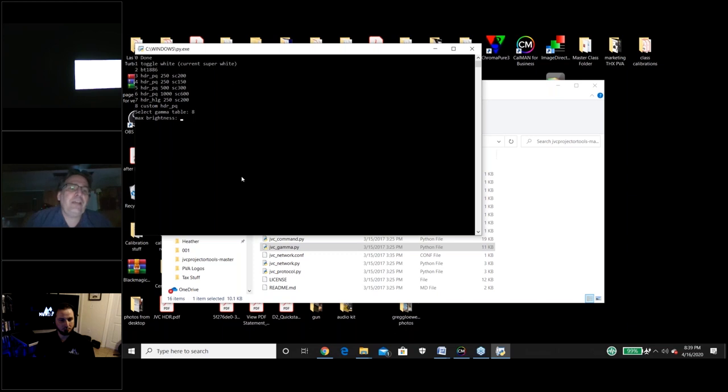If we have a smaller screen, it'll be brighter. We would theoretically say it's a brighter number because we have less square inches to light up. And then if we have a larger screen, it'd be a lower number. So we can do several readings in here. So let's go ahead. I'm just going to choose 900 for screen brightness right now. And this is somewhat guessing, but you want to use a larger number for a brighter screen and a lower number for a dimmer screen.